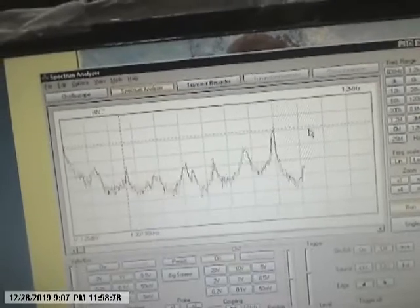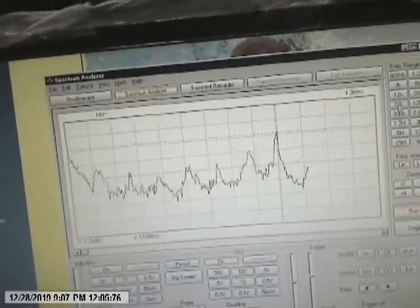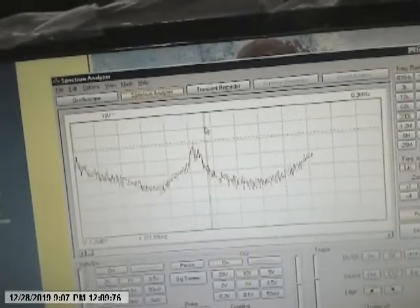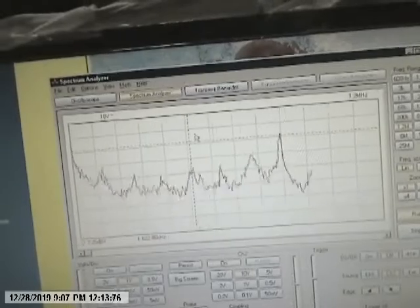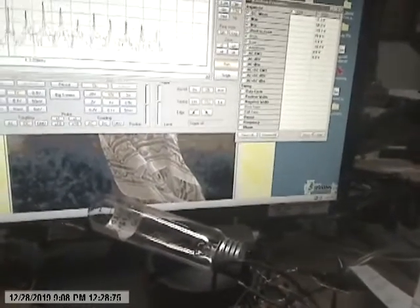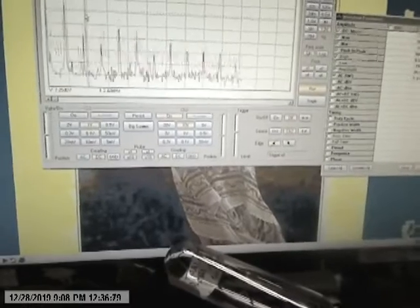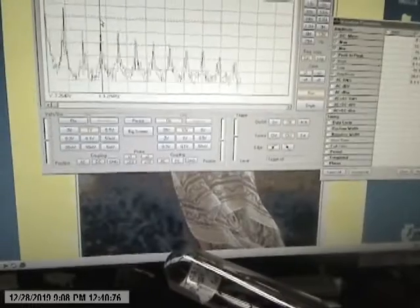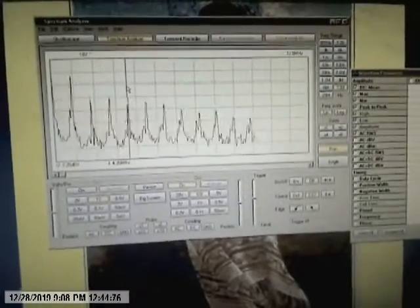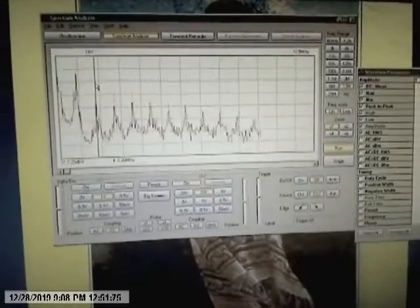And if we go back to this, here's the same thing at 1.1. Here's the one peak — you have to find which one your core uses. This TV core I dug up is at 1.1, but like I said, it'll also resonate at 2.5 — maybe it's 2.15, in that area around 2.2. That one will start coming around, but not so much the others: 3.27, and this one's at 4.35. Those will be there, but not as high as the 2.2 MHz area.